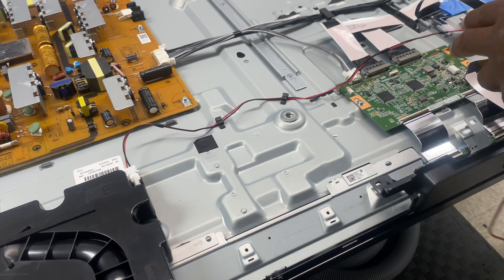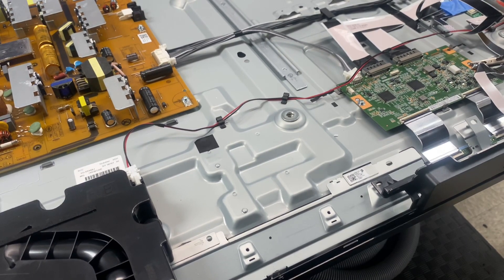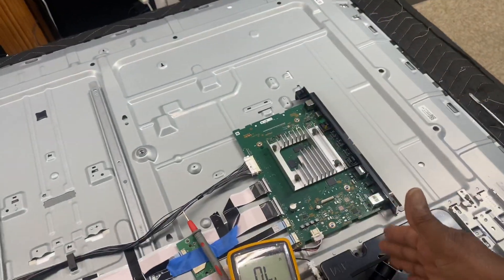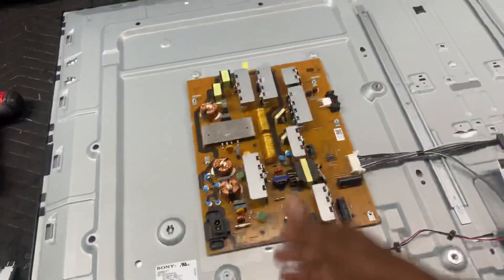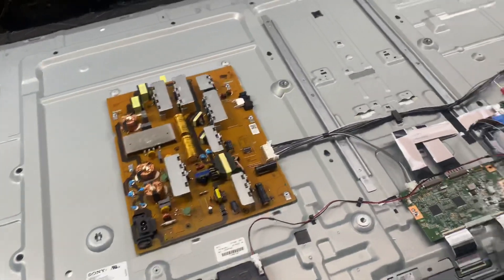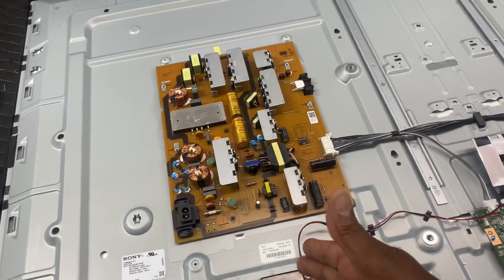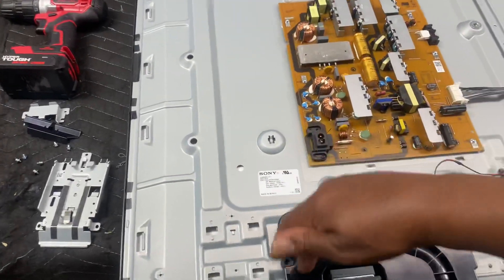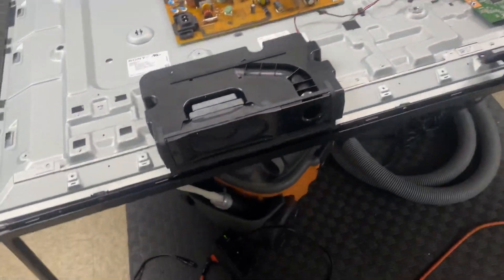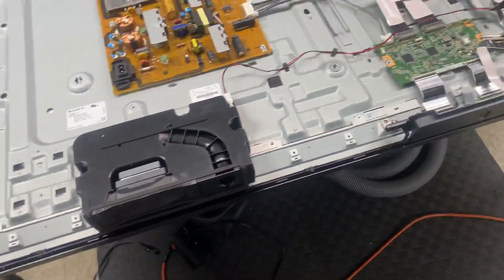I've disconnected and removed three parts of the panel. If you take the panel and slice it in half, then slice that side in half, and then this side in half — you get one quarter, two quarters, three quarters, four quarters — one whole panel. So right now this side is completely connected through that cable. The other side, half of it is connected through that cable because we disconnected one section. So that last quarter won't have any connection to the board. Now we can test whether it's the whole half of this panel drawing our voltage down, or whether it's just a quarter.